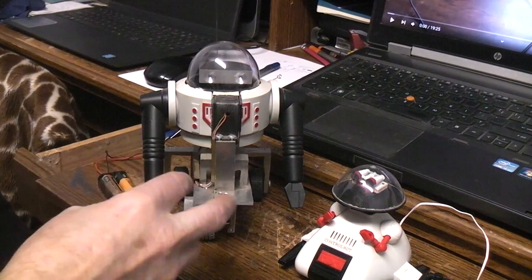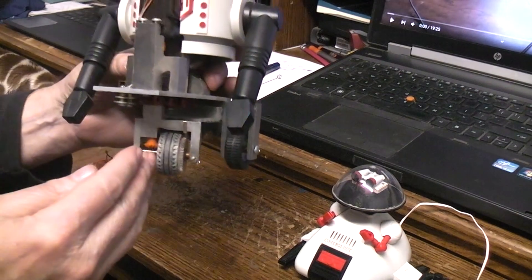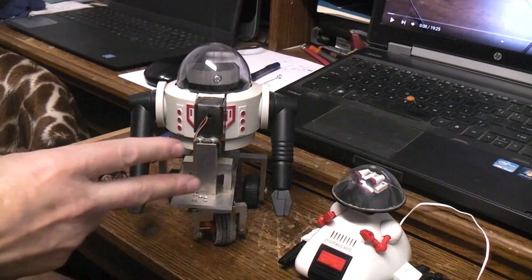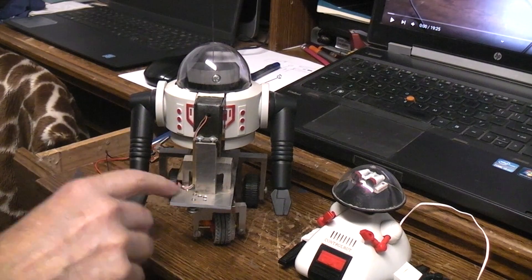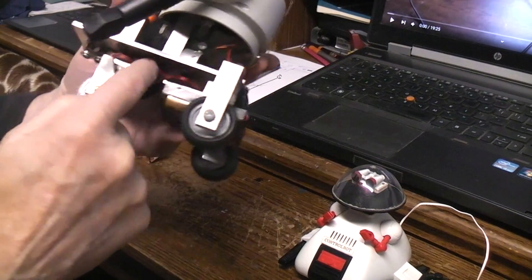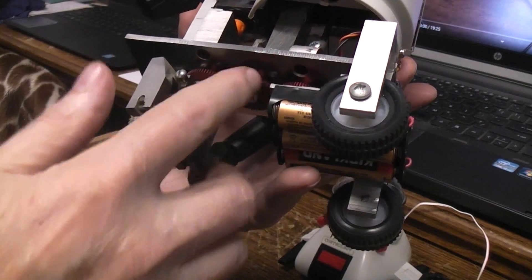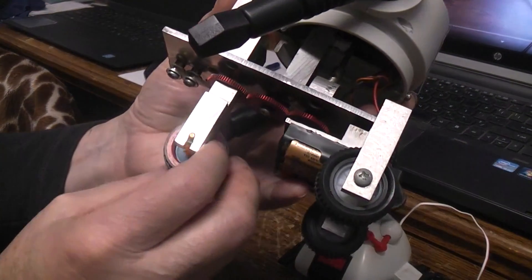When you do it the other way, where the motor is actually part of the drive wheel below, you've got the issue of bringing motor wires up into a commutator for both wires to supply power so you can run it forward and reverse. This system eliminates all of that because the motor always stays stationary to the body — it never moves. You just have a simple drive to the wheel. I used metal gears here, and this one in between keeps everything in sync so the head turns when the wheel turns, always facing the right direction.